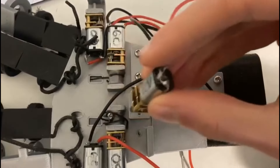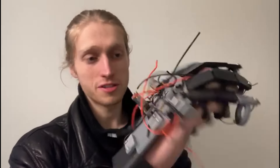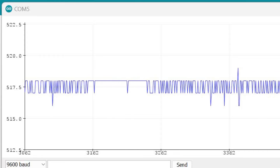The first movement isn't too bad — angles are a bit weird, but we're going to use a similar method to the fingers, this time the motor's doing a handstand. The other movement I can't actually do, because the place where I need to put the motor is occupied, so I'll let the user do that bit of movement themselves. It's a bit of a stringy mess, but this thing feels so cool to wear. The range of motion is pretty non-restrictive — so much so that I can even sort of cook dinner with this thing. Since the thumb rotates so differently to the fingers, it's got its own flex bend sensor, its own type of values, and its own control system — but the four rules are basically the same as the four-finger one. You've only got two sensors for five digits, which does partially invalidate the control system, but I'm gonna ignore it.